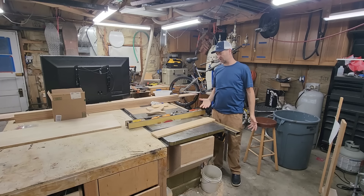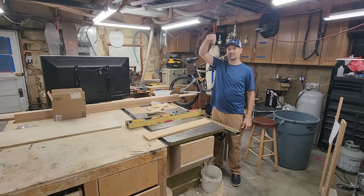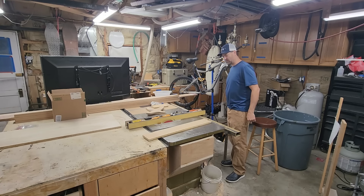What I'm going to do is just cut strips of three-quarter inch plywood. I'm going to use one and a half inch trim head screws to attach it to the top of the face frames and the sides. That's what I'm going to nail the crown molding to.